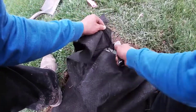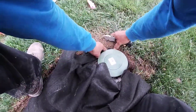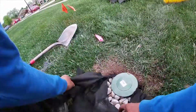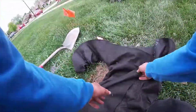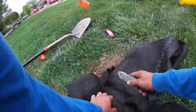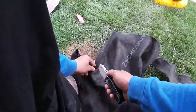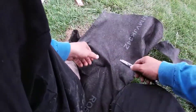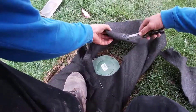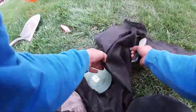So it's just low pressure, French drain gravity. And honestly I don't think a whole lot of water is even going to come out of the pop-up, because it usually just goes out the fitting where it connects to the pipe and all the holes that we drill in it — because we don't want that to be a place for mosquitoes to breed. So Valentin's cutting out around that pop-up.